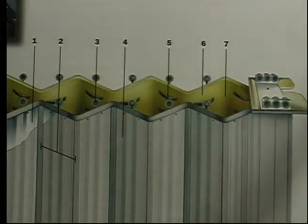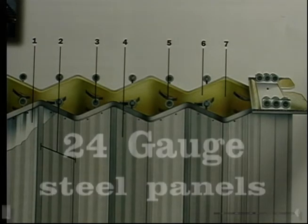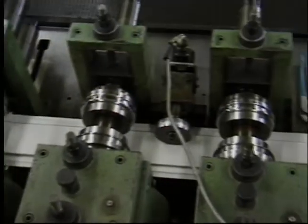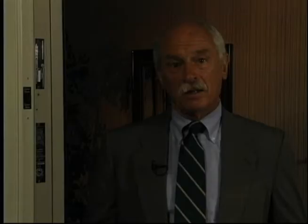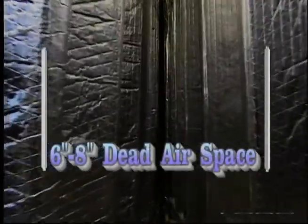The accordion fire door manufactured by the Wondor Corporation is constructed of two separate walls of 24-gauge steel panels. The panels measure four and a half inches wide and are corrugated to add strength. They are individually suspended from an overhead track by a steel pin and roller assembly. Smoke gasketing is provided, and on some models there is a special liner on the interior of the door. Between the two walls is a dead airspace measuring between six and eight inches.